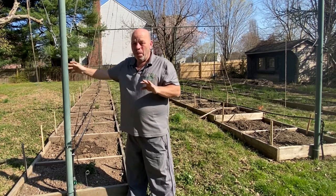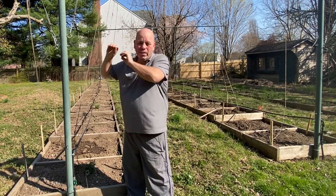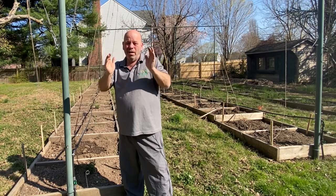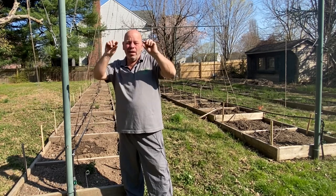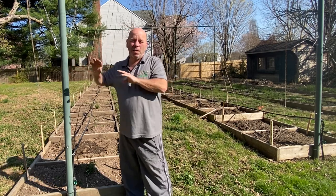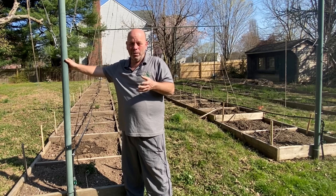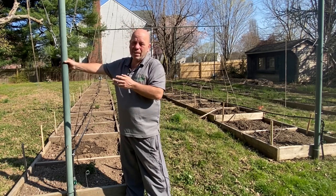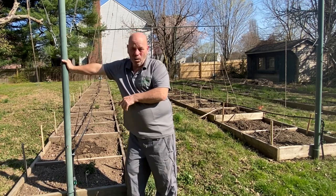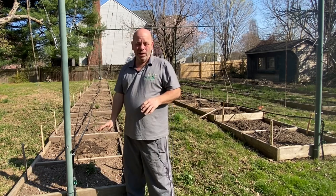At least fourth. But I kinda designed this as one post with a T, and then I made it into kinda like a field goal, soccer field goal kind of thing. And then when I ended up figuring out what size pipe that they sell and the lengths, I just took advantage of them and used the full length of pipe, which came to 21 feet. So the trellis is 16 feet tall and 5 feet in the ground. There is concrete in the holes. They're 8-inch diameter. I left the concrete down a little, so I just fill it with dirt.